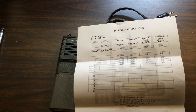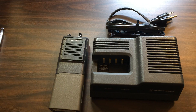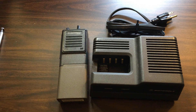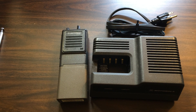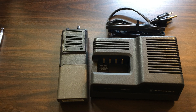I wanted to get 29.3 megahertz programmed on there, because in Asia and Europe that's their 10 meters simplex frequency for FM. Here in the States it's 29.6. But they couldn't program it that low — it is possible, you have to modify the software a bit, there are guides online — but the person who programmed this one for me didn't have that worked out, so couldn't get that frequency. Maybe in the future.